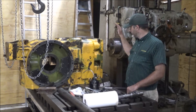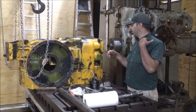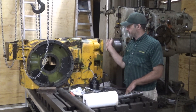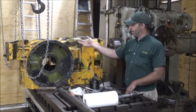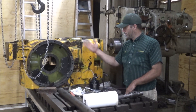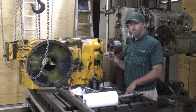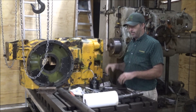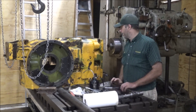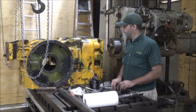I can only indicate the first bore. I don't really have a good way to indicate the second bore in there from this end because it's 12 inches past where my chuck can even go in, and I can't see anything in there. If I had an indicator up in it, I couldn't really see it because it's cast walled down. So I'll just take a real small cut and if it looks like it's cutting even, then I'll know that it's all parallel to the top surface. If it's not, then I'll have to back up and figure out some way to determine what that alignment is.